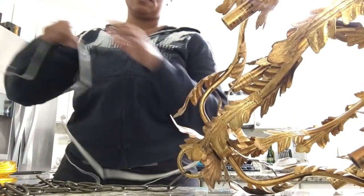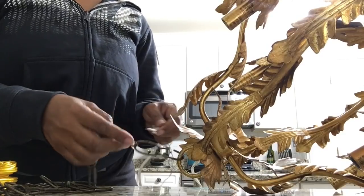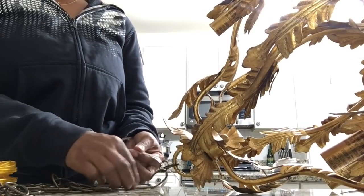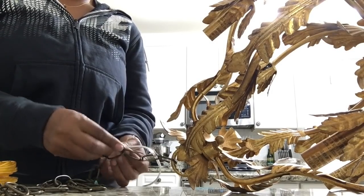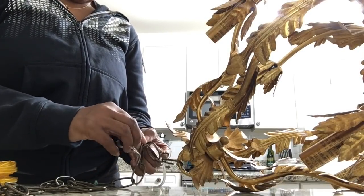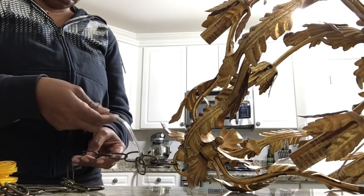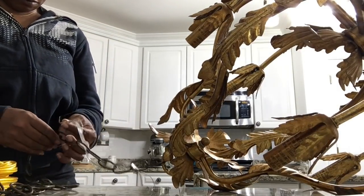Now that I have the chain hooked onto the top of the chandelier, I'm going to take the existing chandelier wires and thread them through the chain. My method is to go through every other link, because that gives me a little wiggle room to adjust the wire when I'm done. This one has a ground wire — I won't be using that one, but I'm keeping it on the chandelier because you never know where it may end up in the future and you might need that grounding wire. I'm just going to thread it through and wrap it around the plastic-covered wires.